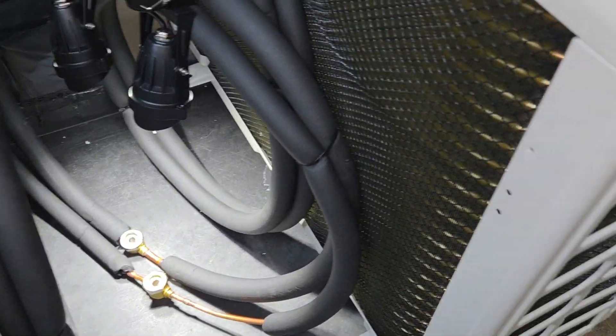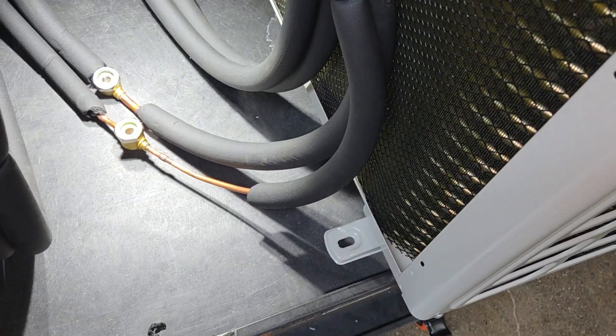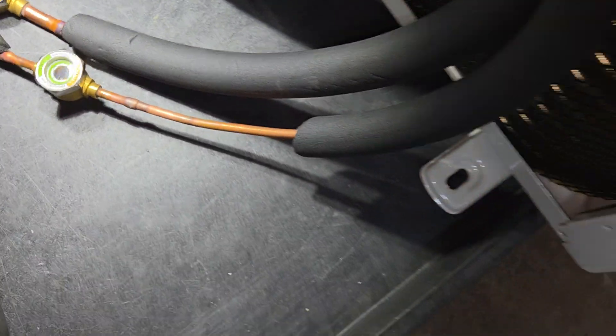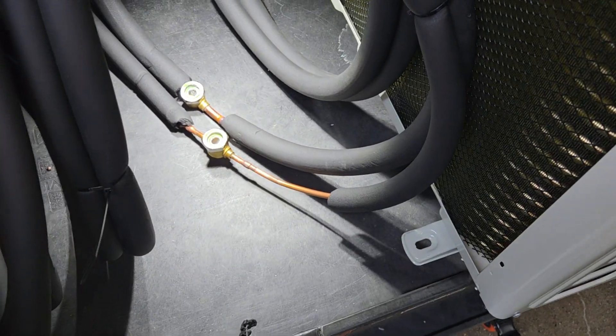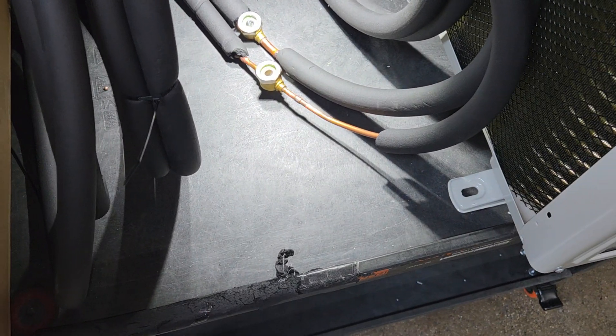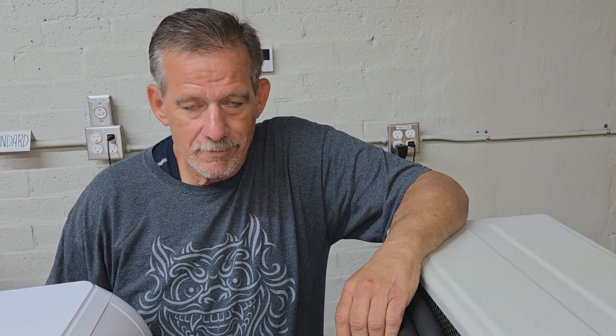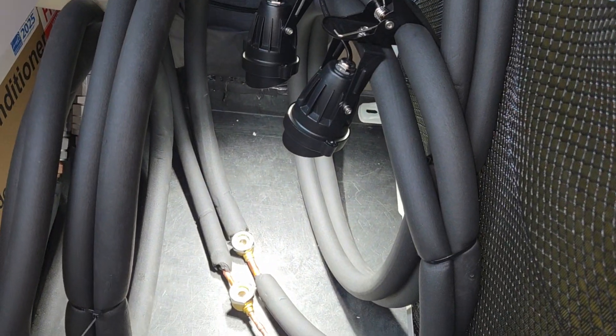So that's sort of the conclusion: both parties are right. There is oil that does get trapped in here. But the unit designers design accordingly because they know this is a potential issue, so they put more oil in there than necessary. You're probably wondering why the refrigerant was boiling with no heat being applied to it — because it's considered a volatile gas, which means it boils at or below room temperature. So it'll boil all by itself just being in the room.